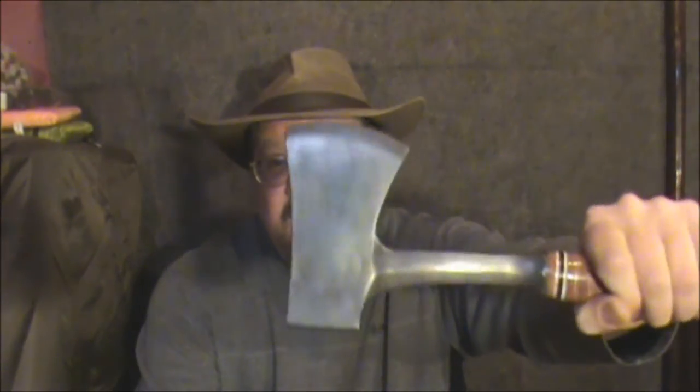But you'll see, like I said, it's pretty dark except for the edge. What you do is you get some gun bluing, and that's where you get the nice dark color. Put a coat on — I actually had to put several coats because I'd find something I hadn't sanded off, then strip it and sand again. But you put a coat on and it just swabs on, and it turns the metal almost jet black. It's made for gun barrels. You can pick it up at most big box stores with a sporting section, or Cabela's and all the big sporting goods stores carry it.